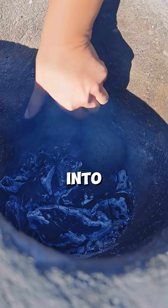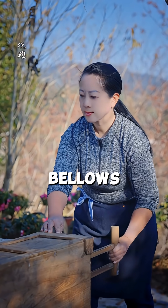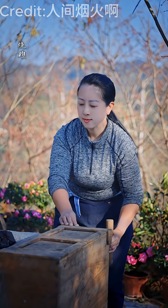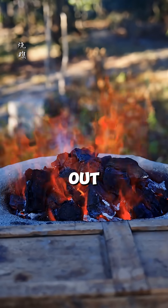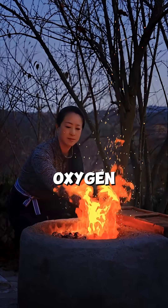The balls go into a furnace layered with charcoal. She uses a hand-pumped bellows to drive the temperature over 1,000 degrees Celsius. This smelting process melts the lead and silver out of the rock, while the carbon from the charcoal strips away the oxygen.